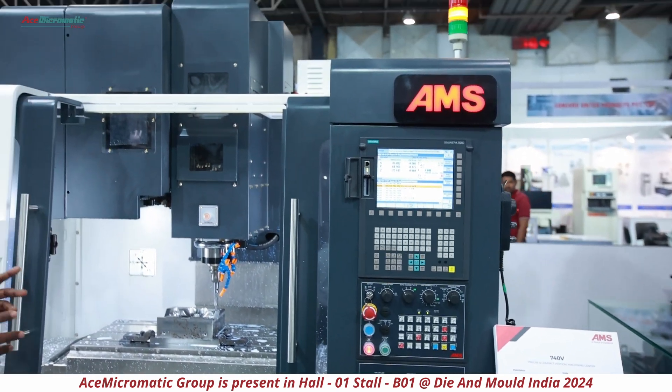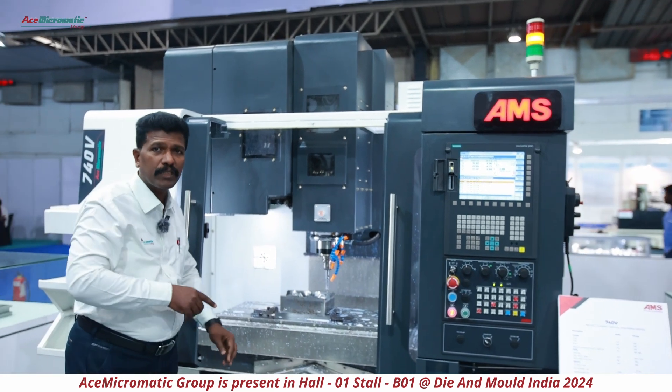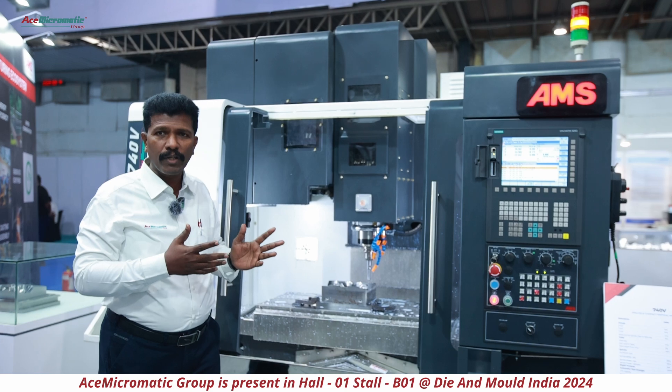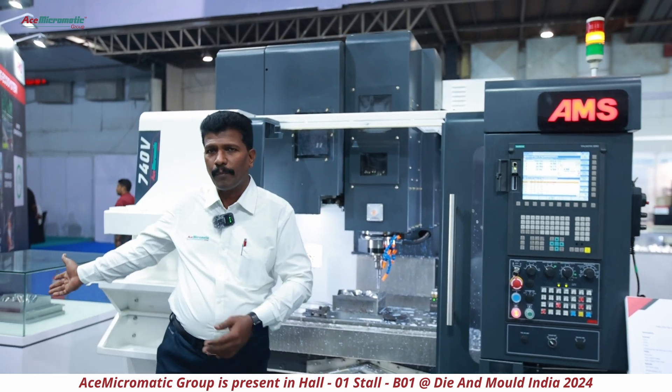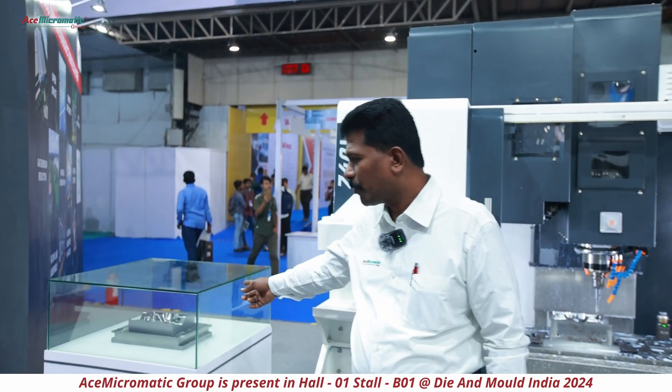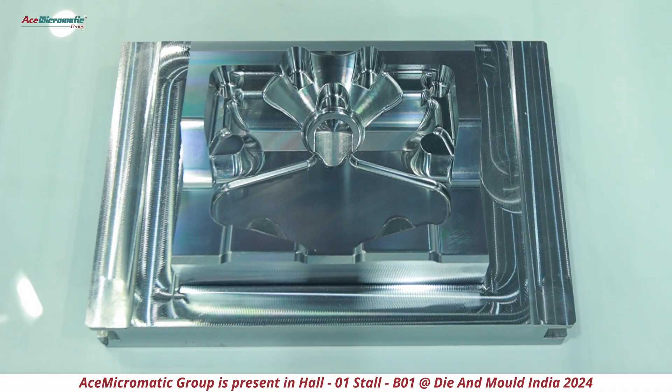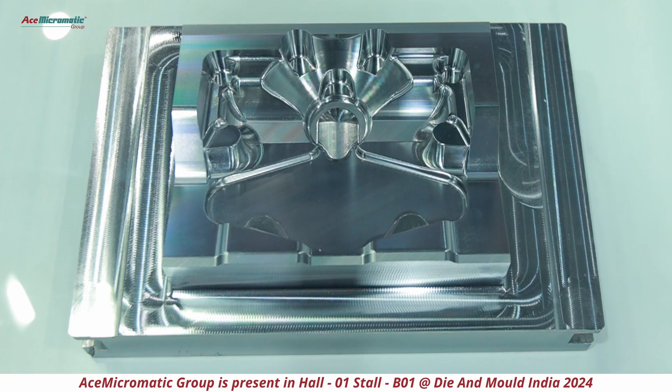You can also use it for all hot forging dies. The load carry capacity of the machine is almost 800 kg. We have already completed one component — please come and see the pot. This is a very well-finished pot, and you can see a mirror finish with a surface Ra value of 0.5 to 0.6.